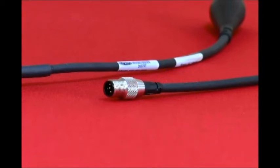The cable also has a very strong but very short strain relief in order to assist in maintaining the cable integrity. Internal to the strain relief and the locking collar is a ratcheting feature which allows the cable to be tightened down and not loosen from the 5-socket connector on the CSI 2130 and 2140.